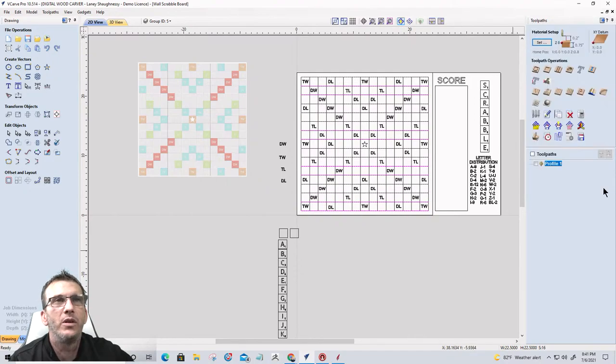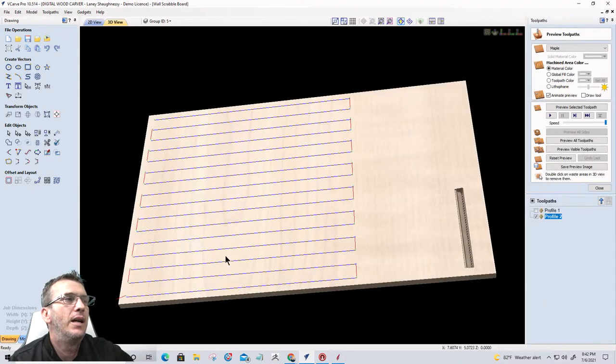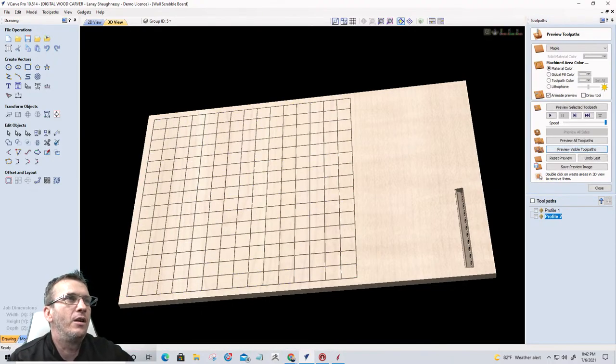I keep getting my horizontal and vertical screwed up. Again, same profile cut here. 16th of an inch on the line, start at, optimize the start points, calculate that tool path. So I get that back and forth motion and all. And now we preview that visible toolpath. And so we've got our grid here,